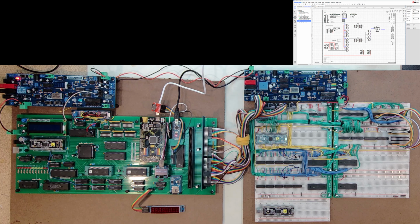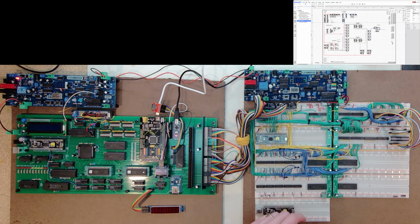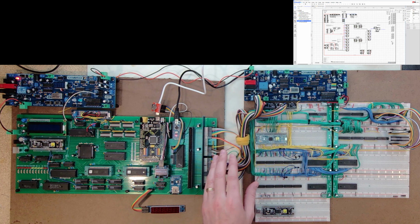In the last video, I came into my system and started to get the PSOC connected. I connected the multiplexers for frame 1's VRAM, and then I connected the transceivers to get that data back out to the bus. All of that coming through the ISA bus into my 286 system.